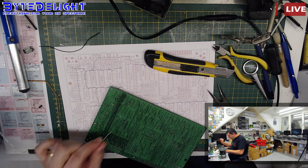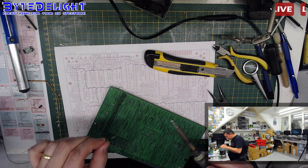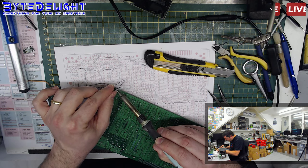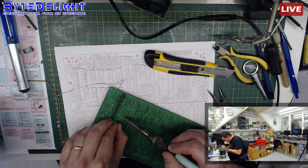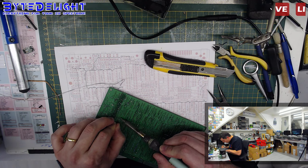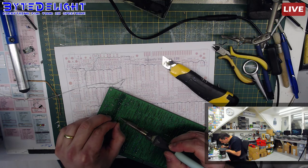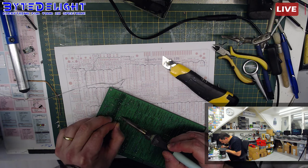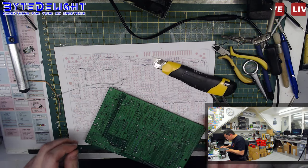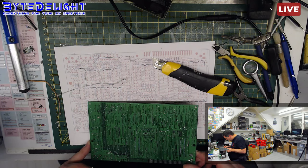So I never expected that the issue was a broken pad. Really, and especially at the actual voltage regulator itself, that's not what I would have thought of. I'm glad I found it, but I didn't feel that good about it. I always use some super glue on these kinds of connections, but it's for later. First I want to find the other cuts I did.